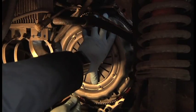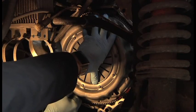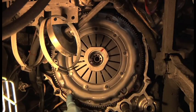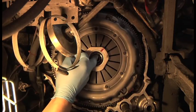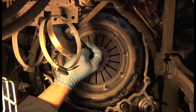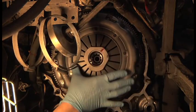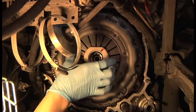And then all I want to do is just get in a bolt. So anyway, I'm now taking this out, and because it's only loosely done up with two bolts, I can push this around. You see, I don't know if you can see it's moving. So the idea is I'm going to look straight down the barrel, adjust it, and nip it up a little bit tighter, and then I'm going to offer the gearbox, the bell housing assembly to it, so that it will all line up nice.